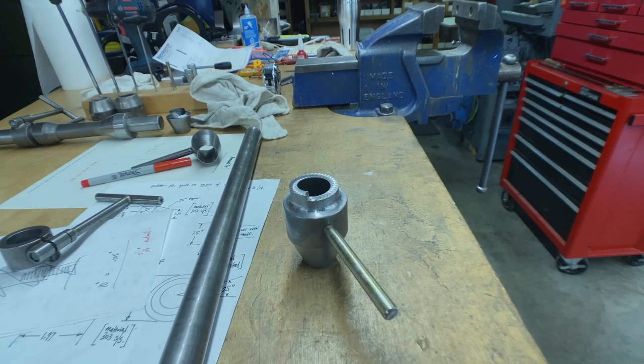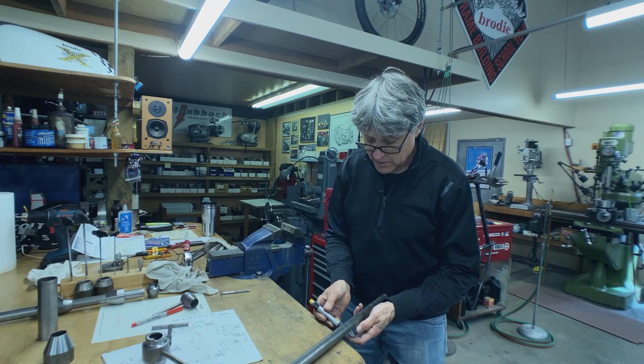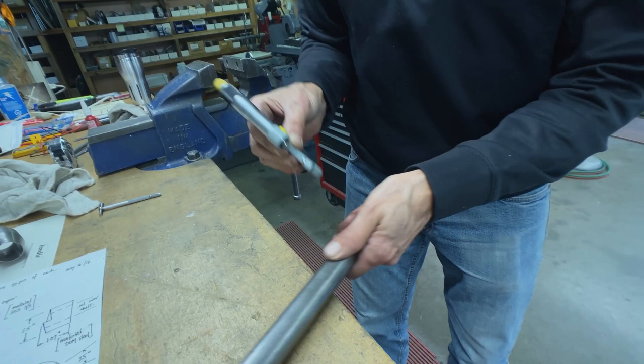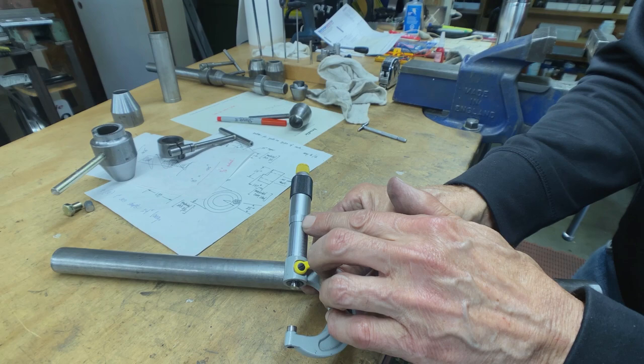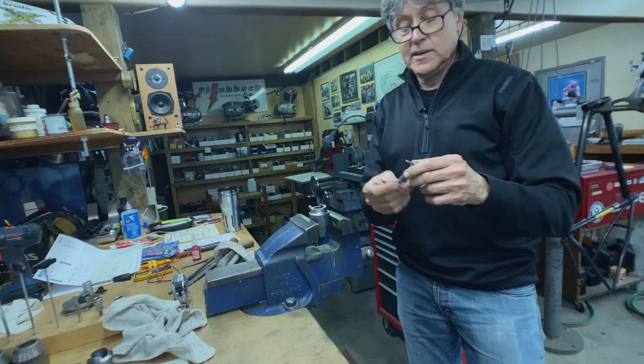One handle done. This is an inch shaft — it's just cold roll, nothing fancy. So I'm going to measure it, and often these stock pieces are a little bit undersized. I read the dial at 9-9-8, so it's 0.998 — it's two thou under one inch. For reference, a human hair is two thou, and a coarse human hair is three thou. So this shaft is two thou under an inch.